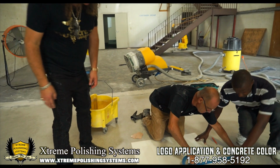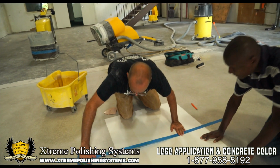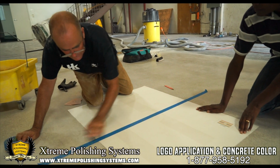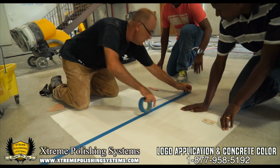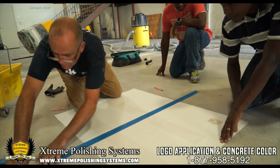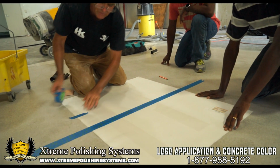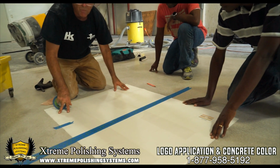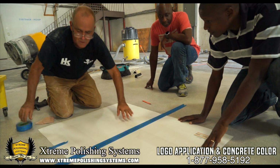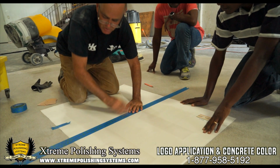Here we got Dr. Jimmy getting ready to tape off the logo, and Jimmy's going to explain to you as he goes what he's doing and why he's doing it. You're going to get on that side. So we're just going to tape this all the way across, and that's so it doesn't move. Because if you put a little piece like this here, trying to save your tape, it'll move. This way, it won't be able to move. It stays right there. So I usually put two. One is more than enough. Go all the way across in the center.